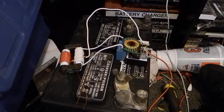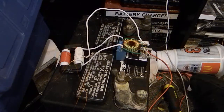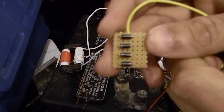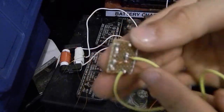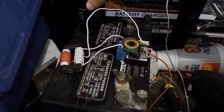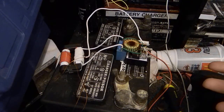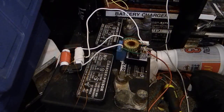I'm going to run that through this little setup here from the old test — just 1N4937 diodes in a bridge rectifier configuration that runs to this capacitor here, which is a 450-volt capacitor. I'm going to try that out and I will get back to you guys sometime later today on the results — on charging that capacitor. Anyway, peace out guys, hope you enjoyed the video, see you in the next one.